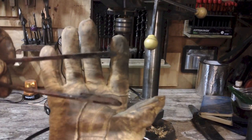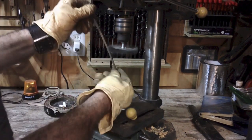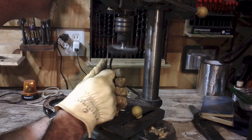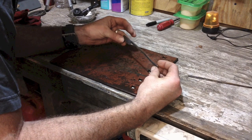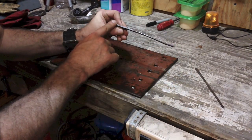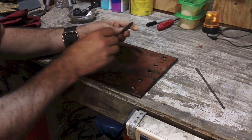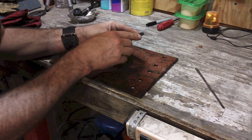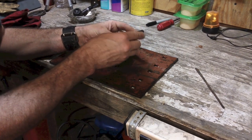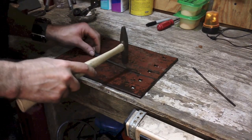These irons are rusty, so I'm going to give them a good brushing and clean-up. The body of this iron is wrought iron — that's why it's called an iron. You can bend it really easily and put it back. They take a piece of steel and forge-weld it: get it above critical temperature, 1,330 degrees, beat it together and it becomes one. That's where your edge is, and the steel holds it. But I want to get these into a little better shape.